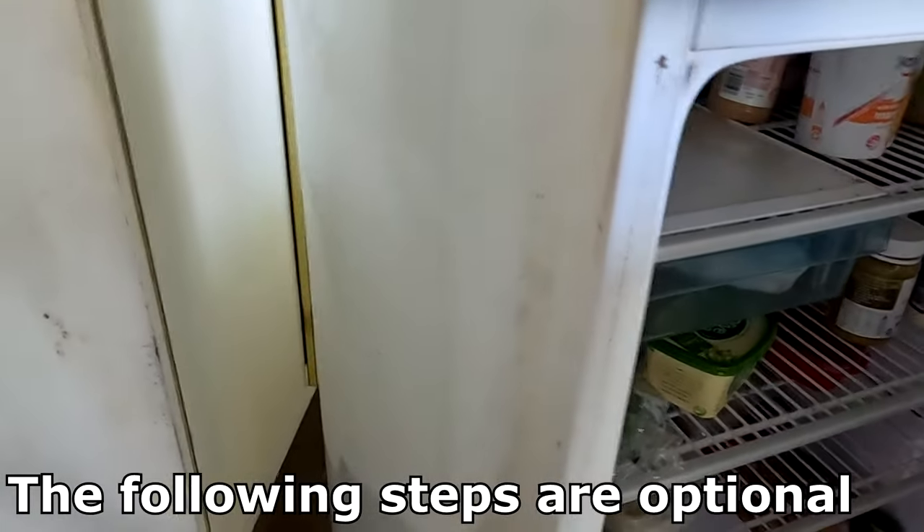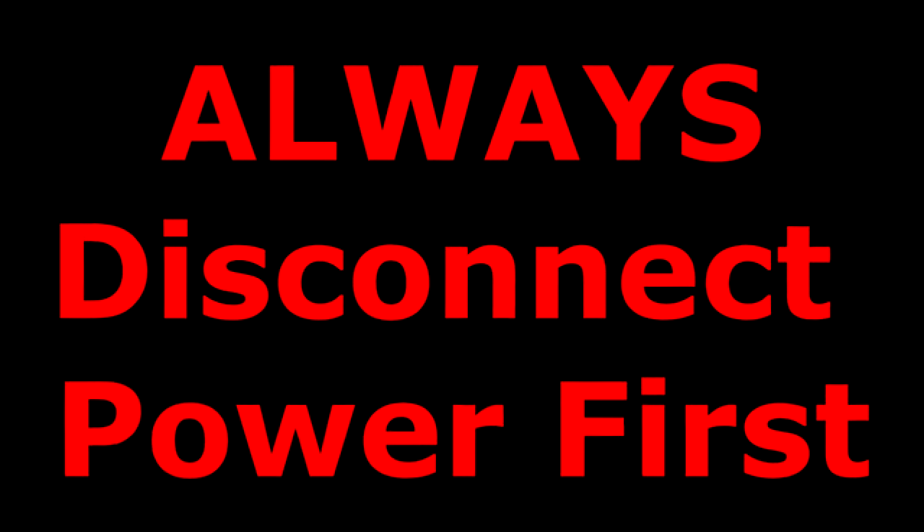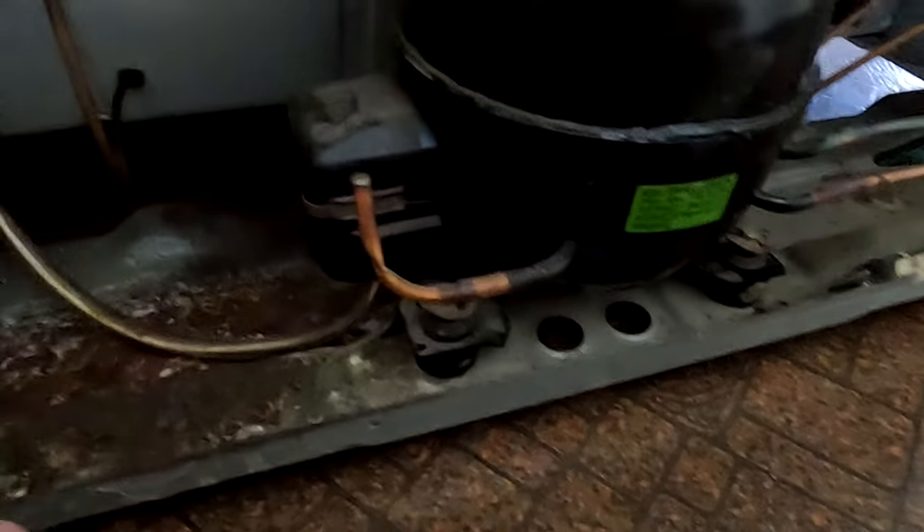Get your air gun and blow it through. Now, I've already done it before I filmed, but in this case there's a drip tray — very carefully unclip the coils from the plastic holders, then take the drip tray and give it a good hose out and clean. Also underneath where the drip tray was, you can see a little drain there — carefully do the same and give everything a blast as well. It won't hurt.